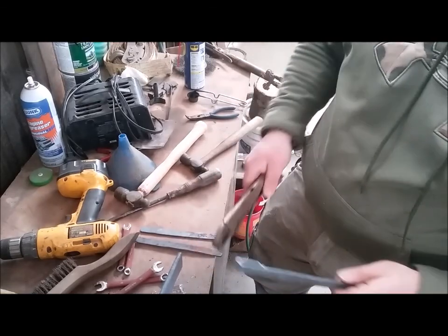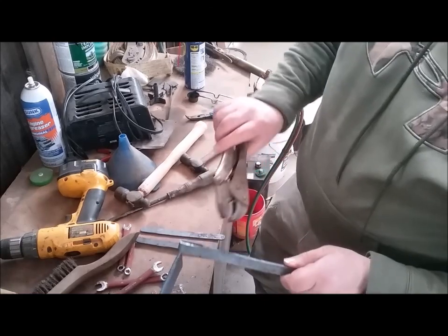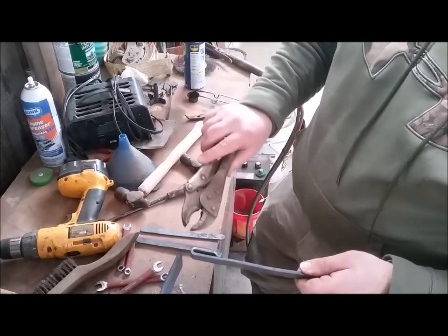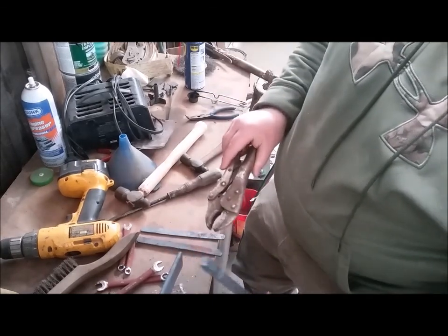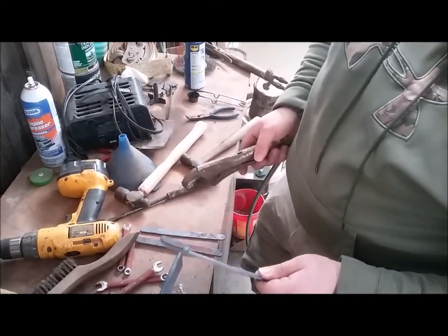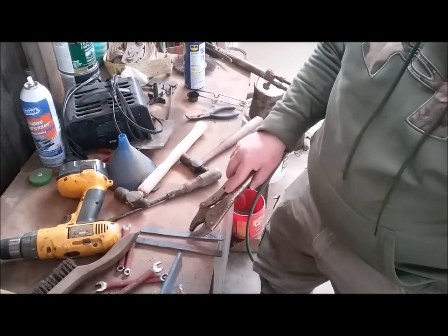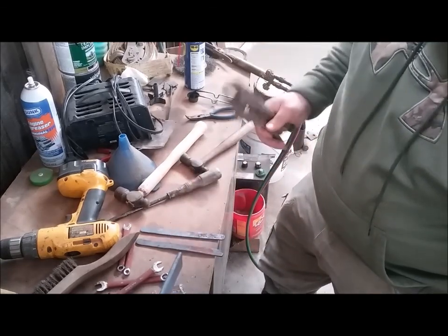Just find a chunk of steel the size you want for the clip section, bend about a finger height over, bend a small cap of that back to form a hook, and then just hook that bottom underneath and bend everything right over — and boom, all done. I am going to do that to the next two, drill some holes, and then we are going to come back and finish up the holster.